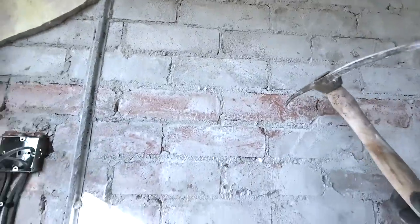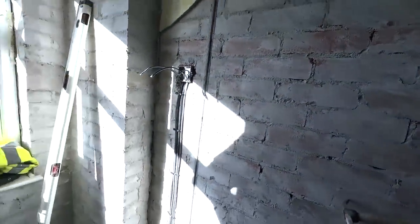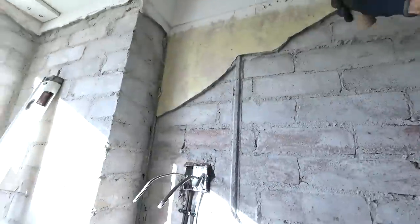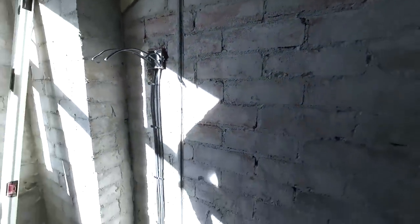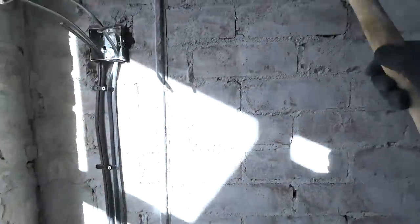These are concrete bricks, pretty much the same as the outside, except the colour is mixed in with the ordinary concrete. They're the same as the face brick, aren't they? It's not like they're all chipped, they're all good bricks. Right, to the back of the brick. Hey, that's nice. This is a little bit more of an opening, so we can work to that then. I've got the nice straight pit, and these are concrete as well, so they should come out quite easy. I reckon one stitch drill per brick, we should be all right.